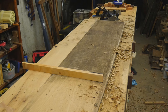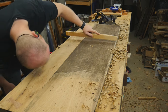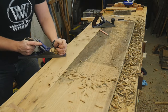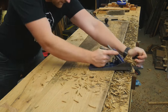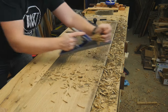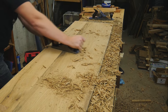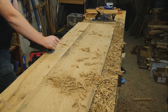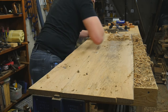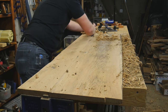Now it's time for flattening the boards. I'm using winding sticks both as a straight edge and to check for wind. There isn't any wind, but there are a lot of humps and bows that need to be taken out. I use a scrub plane to do the vast majority of the flattening — a fantastic tool to quickly take off material and bring things down close to flat. I did a video on making the scrub plane, and you can make one from a cheap old hand plane very quickly. Once it's down pretty close to flat, I come in with a number four and a half and go across the grain to take off more material and get it a little closer. Then I'll run with the grain to give it the final flat and smooth surface, taking out all the ridges left from the last two planes.